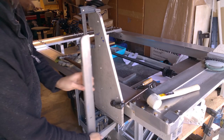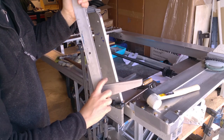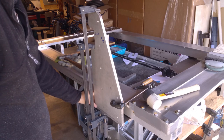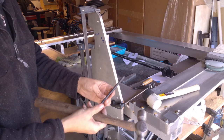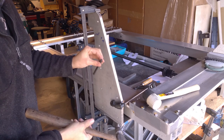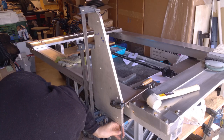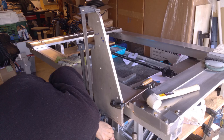Maybe I should have made these a little bit thicker, but I ran out of material. It's clamped in place - I'm not laboring under any kind of misconception that this machine will have interchangeable parts. I have a ball peen hammer and this is a centering punch - it's just got a little dimple on the end of a little piece of turned steel rod. I'm going to go underneath here, find my holes, and at each time I do this I've got to make sure I don't move it.